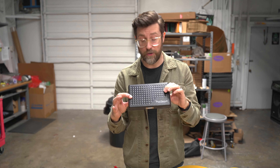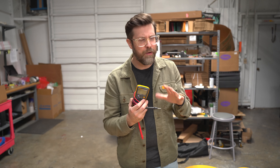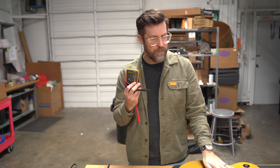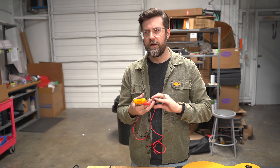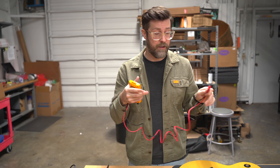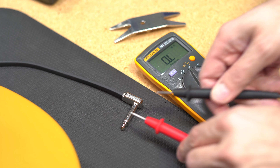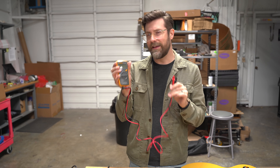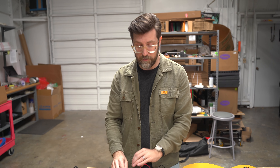Number four is a multimeter. Multimeters can seem intimidating, but it's a must-have tool that every guitarist needs. You can use continuity mode to check if grounds are connected and if your switch and pots are connected properly. You can test the resistance of potentiometers, check the resistance of pickups, and even bias a guitar amp. They're really affordable and every guitarist should have one on their workbench. If you gig with a tube amp, you should have this with you because you never know when you might have to make an adjustment on the fly.